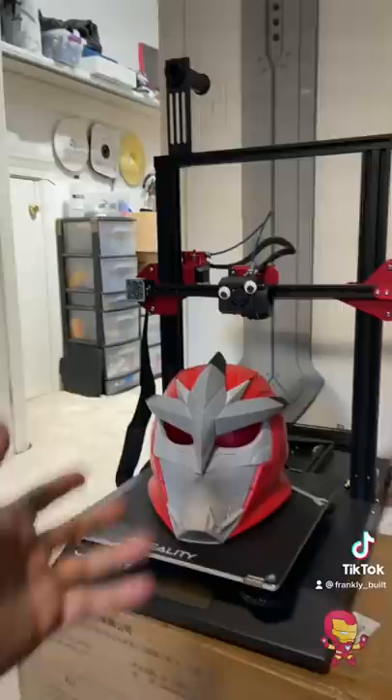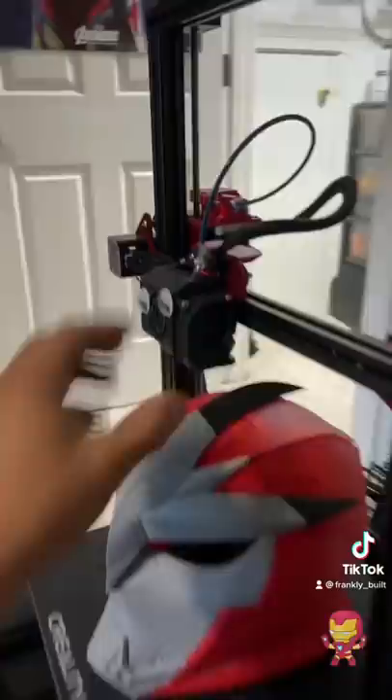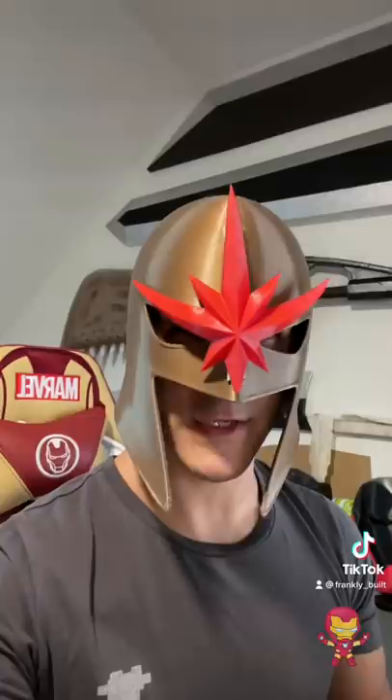And I don't mean the best printer with the best parts and the highest end stuff you can get — I literally mean assembling it properly out of the box. My $150 Ender 3 and $1,000 CR10 Max print the same. I see people every day troubleshooting layer lines and going down this rabbit hole of settings, but their gantry is loose or their bed isn't level. Imagine trying to get an alignment for your car, but your lug nuts are loose. It makes no sense.